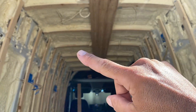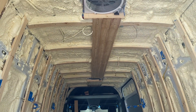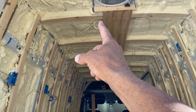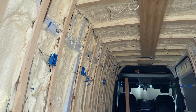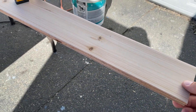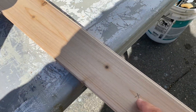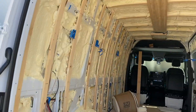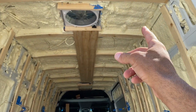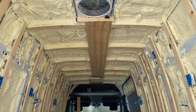You can see where I have my wires for my LED lights coming in. I've measured approximately where I want them on the ceiling plank that's going to go right there. I clamped two pieces together so that when I drill the holes it'll be in the exact same spot on each board — one there and then two over from there. That'll be where the next one is, and the LEDs should be lined up in the exact same spot.